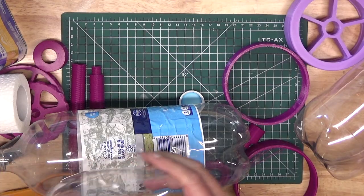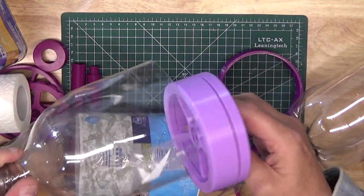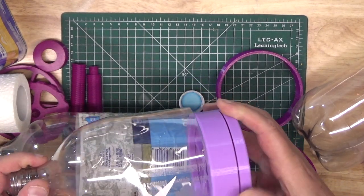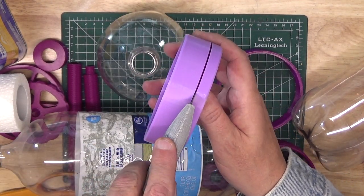So I figured the first thing to do would be to make a platen that could be inserted snugly inside a bottle to keep the sides nice and firm while they were being cut. That was a good first step, but the next hurdle was the knife blade wanting to wander. The solution was to fashion a groove in the platen to hold the knife blade in position as the bottle was rotated.